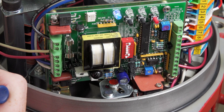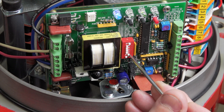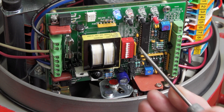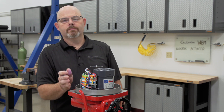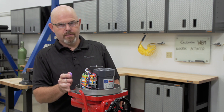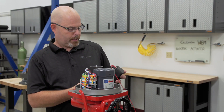Now that it's done, that means calibration is completed. You turn dip switch 6 and 1 back off. And that's the auto-cal function of the TMC3 modulating card on the WEM series actuator.